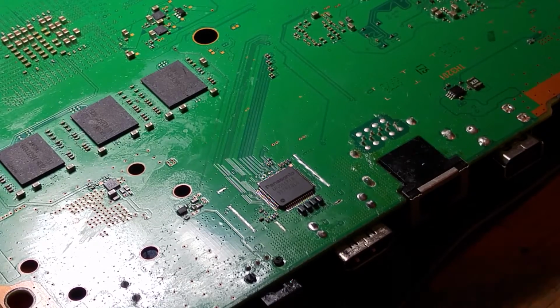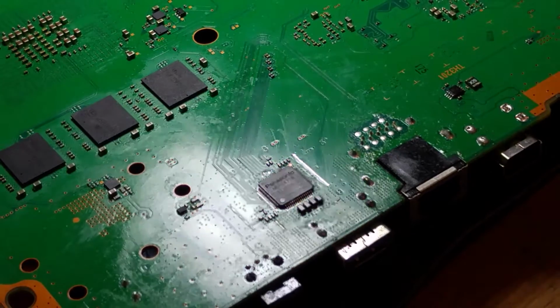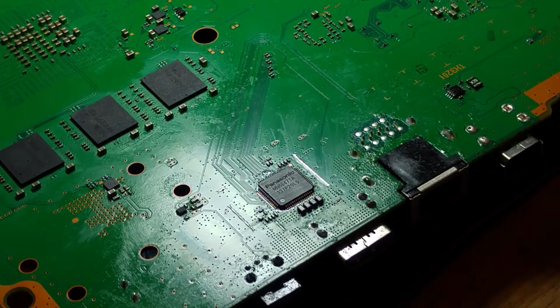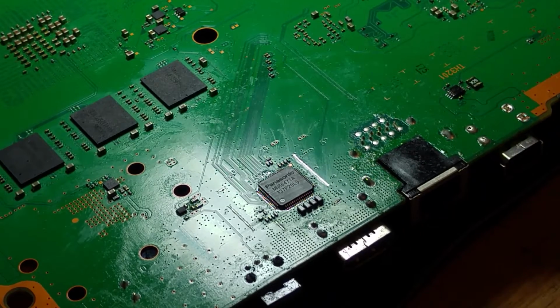So what I sometimes resort to in cases like this, where we've no schematic and we have absolutely no sort of insider knowledge of the workings of these circuits at all, is to stick my multimeter in diode mode and compare those values against a known good working board. And that will tell you very quickly whether you have a problem. So you can get a baseline reading from a good board and you will get a figure, let's call that figure X.